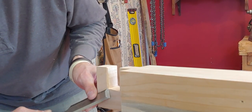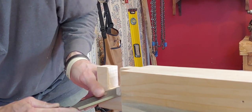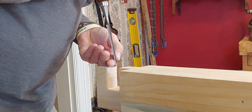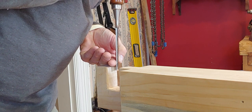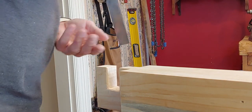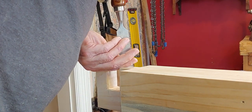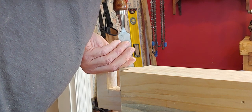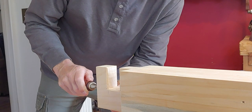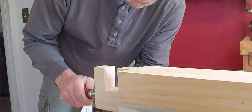Even right down to this bottom line, I'll go in and chamfer that off. Someday you'll be doing a joint that's going to lock together perfectly and you'll see it - when you don't have any clearance and clearance has got to be zero, doing the chamfers is going to save you when you go to put it together.